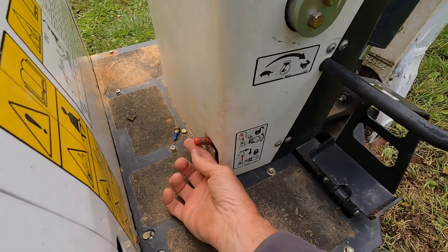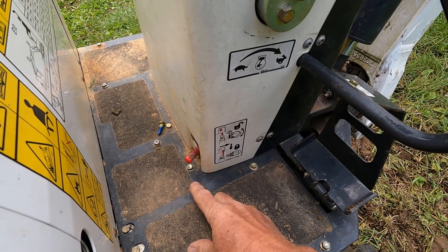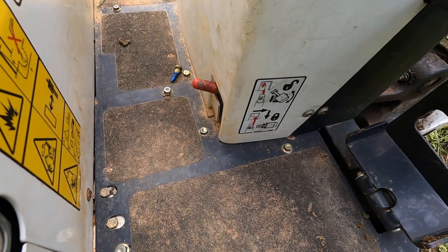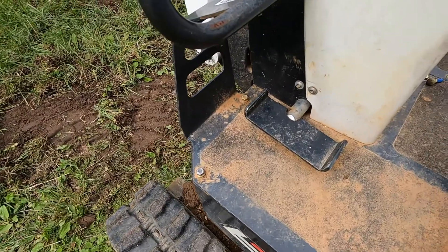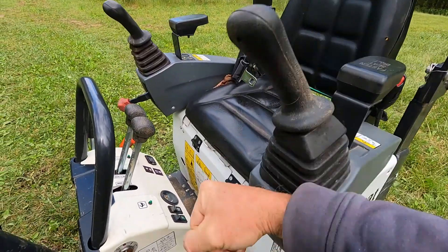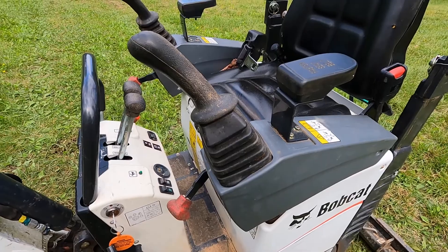That comes in really handy when you're working very close to a house and you need to dig something really close and work parallel to it. Another feature is this little lever — when you push it down, it locks the boom in place and the carriage will not move. So this has to be in the up position in order to operate the machine. This little lever, just like the one on the other side, swings over so you don't accidentally operate it — this is the safe position, this is the on position. This auxiliary hydraulic foot pedal also swings up. The armrests go down to lock in place and also lock in if you want a tighter space to support the sides of your legs.